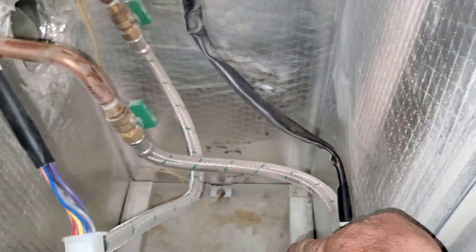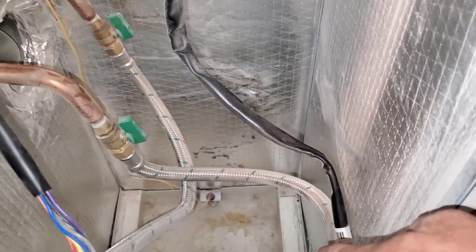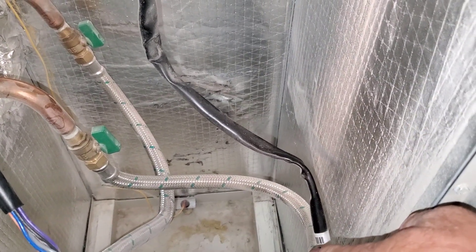Right here is the first sensor on the yellow wire, and then there's a secondary sensor. The condensate just drips down through the hole into the bottom of the pan, and the drain is on the bottom. So if the main drain plugs up, you have to pull this out to blow it out. Those aren't even clamped on, so you have the danger of blowing off the hose underneath.